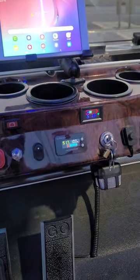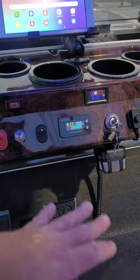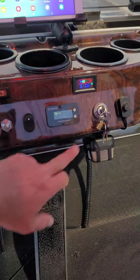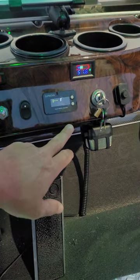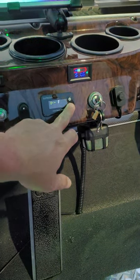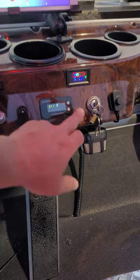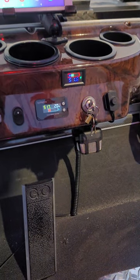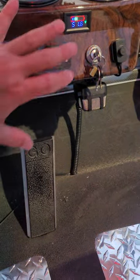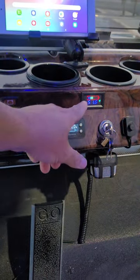It's showing 100% but I have to program it with the number of cells in each battery. I put 16 and it seems like it's working fine. You press and hold — that's F for LiFePO4. It's a nice meter, I got it on Amazon. So right there on 15 — let's do 16, press and hold, and boom, now it shows 20%. This is a great meter. If you get it programmed the right way you'll have a nice meter, and I'm gonna put a switch on it so it's not on all the time.